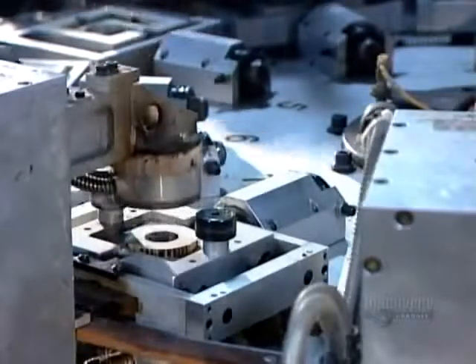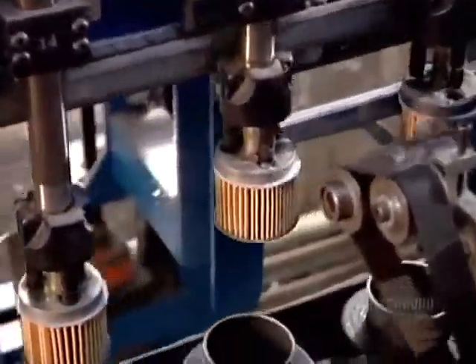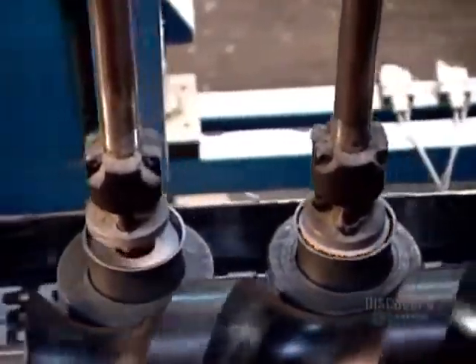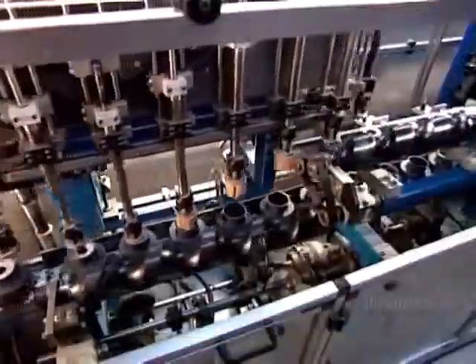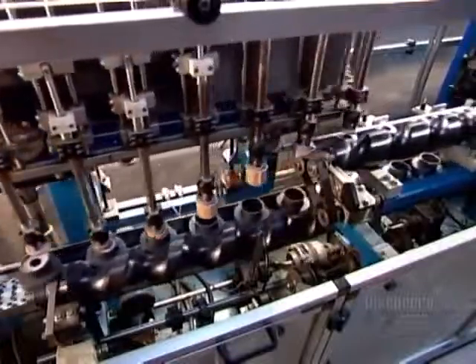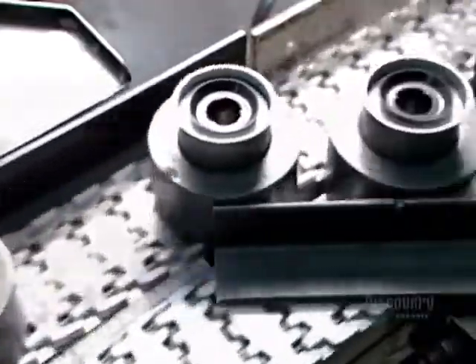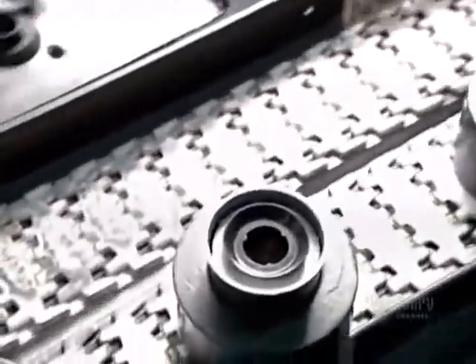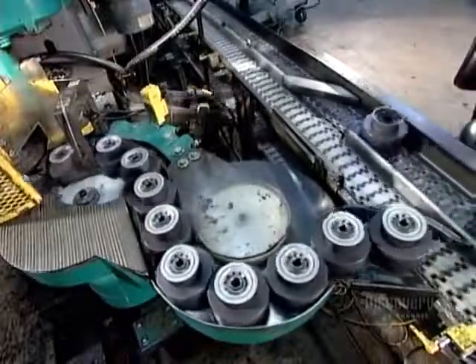The next machine glues a capping disc on each end of the filter paper to hold the tube in place. A heater cures the glue. Now for the final assembly: as the canisters go by upside down, automated arms insert the filter cartridges. A worker then puts a thin rubber disc on top of each cartridge to prevent oil from draining out of the filter. A worker positions a bottom assembly on each canister, then a machine called a seamer folds its edge down, forming a rim — just like the rim of a soup can.